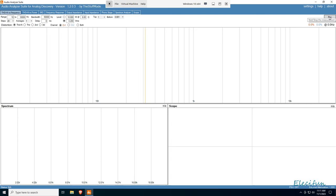And as you can see, before we hit that 1%, which will be coming right up on the edge here, in actual fact, it shows us that we've hit 100 watts. It's possible that we might be able to get a little bit more than that, but I just pushed that right to the edge: 99.082 watts at 0.068% distortion. Right, so didn't quite get up to the 100 watts.